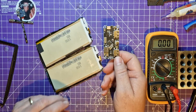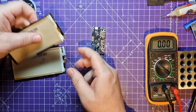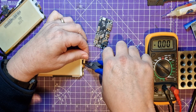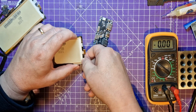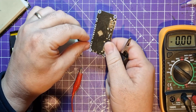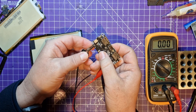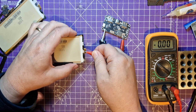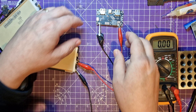Maybe the first thing I can do, after I've got rid of the horrible fiber off the edge of the boards, is wire this up to one of the batteries and see whether I get a voltage out — see whether something lights up. I'm going to pick this one because it's got more of a terminal on it; I damaged the other one a little bit too much. I'm going to try and crocodile clip this up to begin with. Battery plus can pop onto there and battery minus can go onto there, then see if I can get some lights to appear on the board.